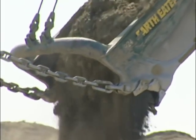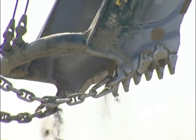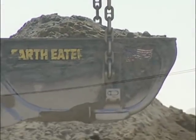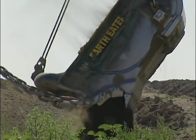This bucket is lighter than other styles. The dragline is capable of a total suspended load — the total suspended load minus the weight of the bucket is the amount of dirt you're able to carry. So instead of the bucket making up about half of the weight the dragline lifts, it's only about 40 percent.